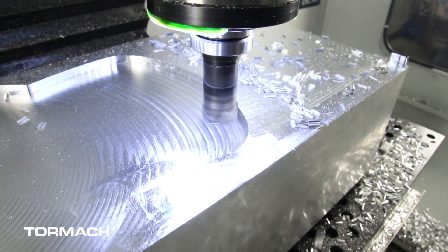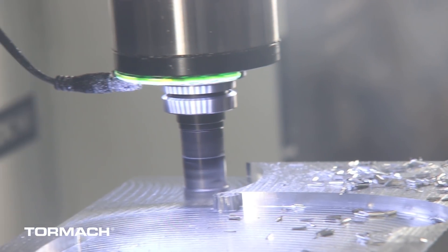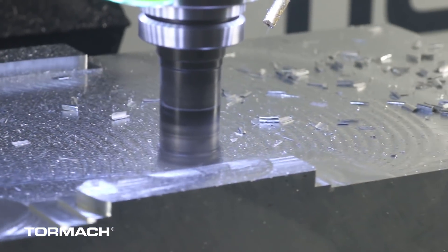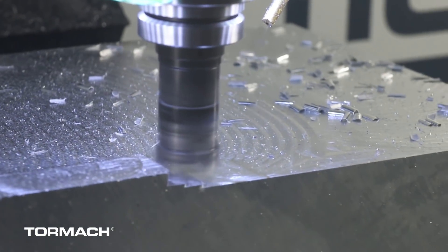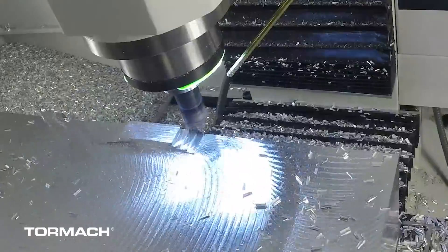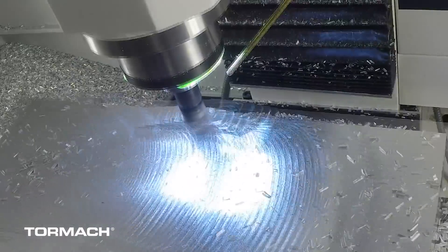On that strategy, we lightened up the width of cut but kept the feed rate the same. We turned the width of cut down about 100 thousandths on the conventional side but left the feed rate unchanged — trying to lean on it for efficiency while also maintaining process reliability with this tool path. I didn't want to stand in front of the machine watching it rough for over three hours, so once we got it running and were happy with how it was cutting, we walked away and let the camera run while the part finished roughing.